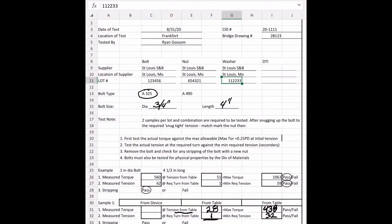Now that we've got the torque reading from turning to initial tension: our initial tension was 28 kips as read from the Skidmore, and our measured torque was 240 foot-pounds. Let's enter that into the table — measured torque of 240 foot-pounds. That 240 foot-pounds had to be less than the maximum torque of 438, and it is, so that test is a pass. The next test is the measured tension at one full turn, which must exceed 32 kips before reaching that full turn.